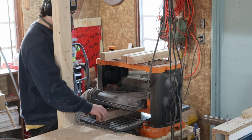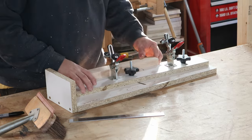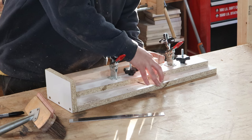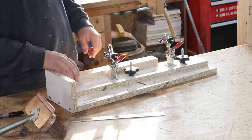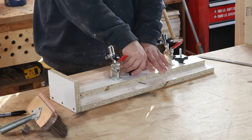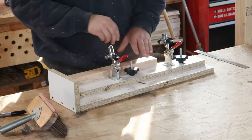I did the legs in two pieces. I wanted to do a four-sided taper for the longer bottom pieces, as I had never done this before. So I made an adjustable tapering jig for the table saw that I really should have made ages ago. It worked pretty well and made quick work of shaping the legs.